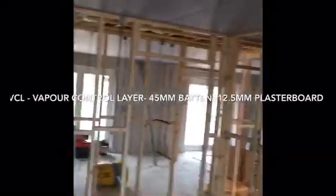Inside you can see the benefits of timber framing — the brickwork's not even done on the outside but the inside is being plasterboarded already. Moving to the next plot a little bit further on — dry lining, taper jointed as a lot of people refer to it on site. Taper joint screws like this. This is over-skimming, it's quick if you've got the trades on site and there's not a lot of moisture in the building.